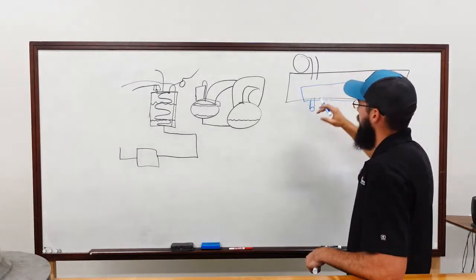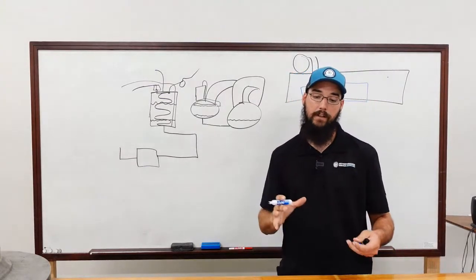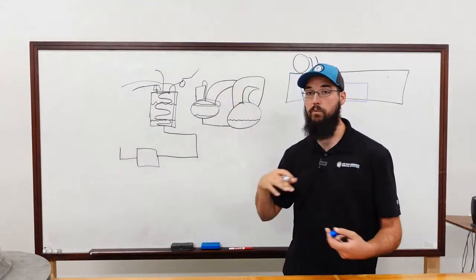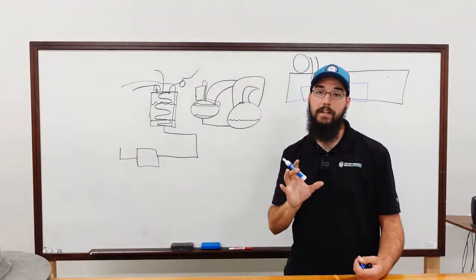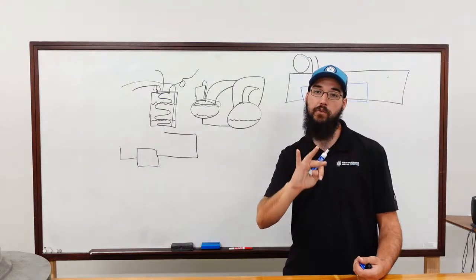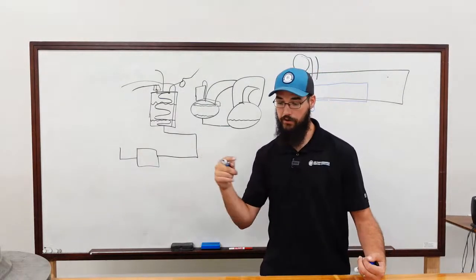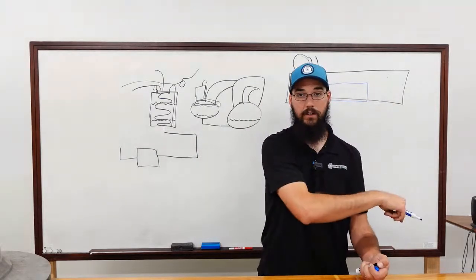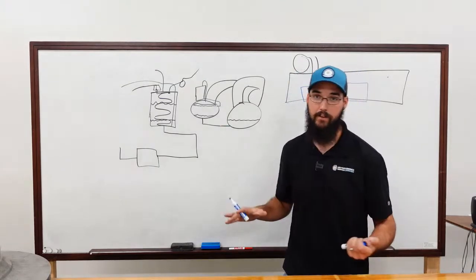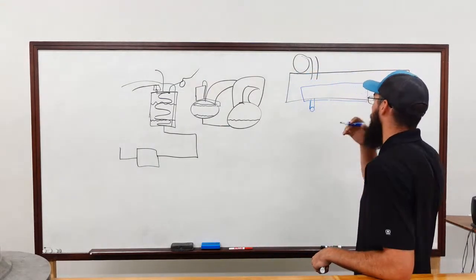In that economizer, depending on whether you have a CVH E or F, now, like I said earlier, what I depicted was a CVH F, it was a two-stage. A CVH E is a three-stage, meaning there's three impellers inside of that compressor housing. So first feeds into the second feeds into the third feeds into the condenser. Otherwise, it's the exact same design and operating concept.